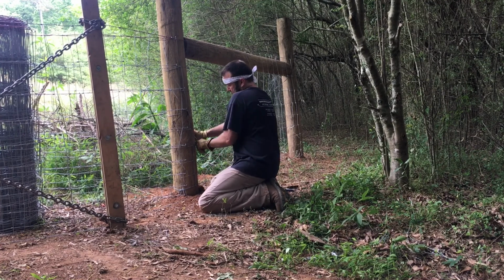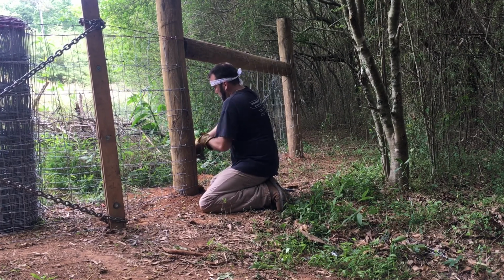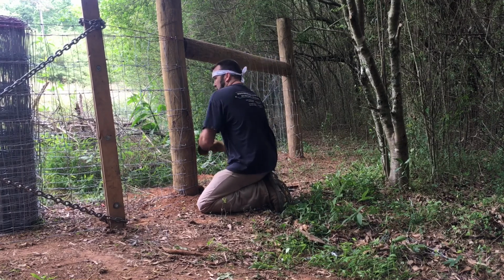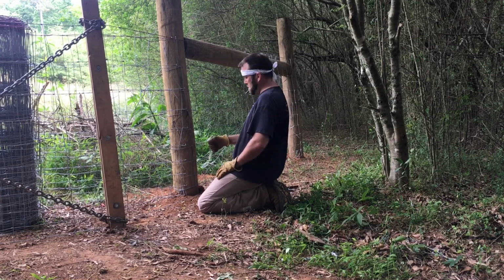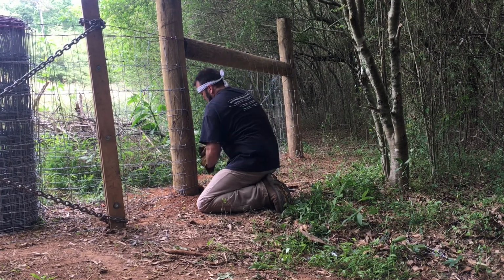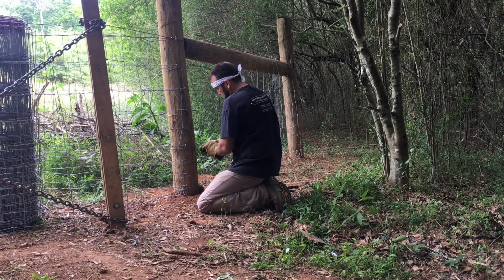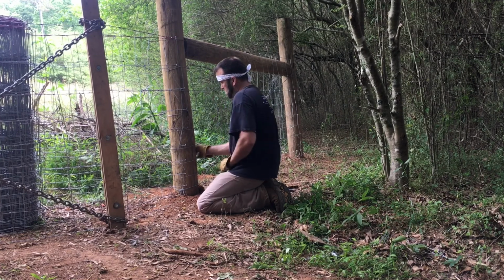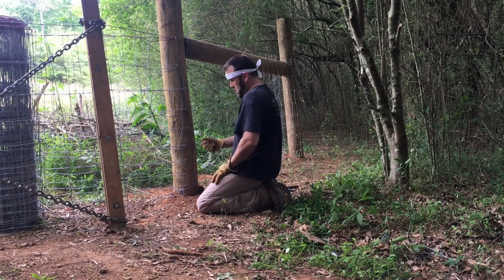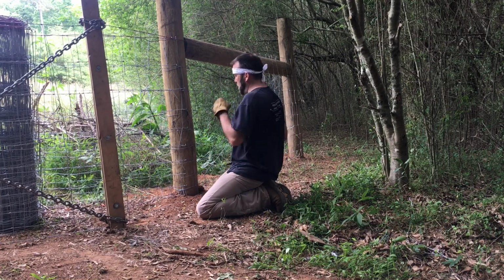But you go over and you go behind this one that you brought back. And I'm not sure, but I think when you come back up on this side. But then the guy from Farm Fence Solutions, I can't remember his name, but he always tells you to grab your handle. So then you're gonna give it three wraps, three tight wraps. One, two, three, and you bend it past, back like that, and you'll grab your handle and bring it back to you, and then twist it toward your wraps, and it snaps off. And you got a good smooth cut right there.